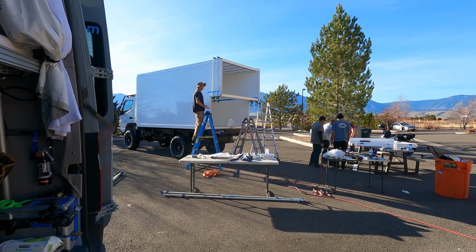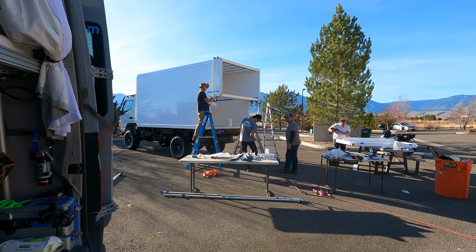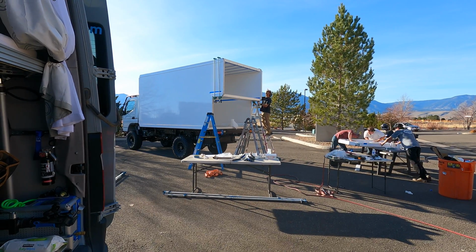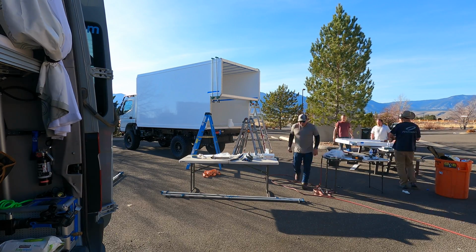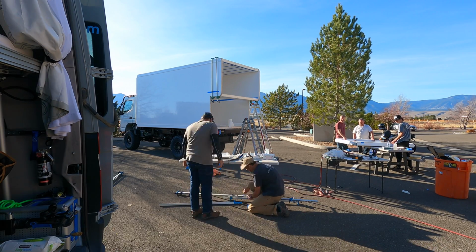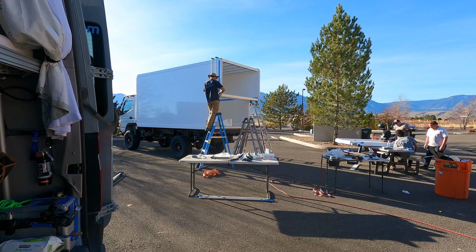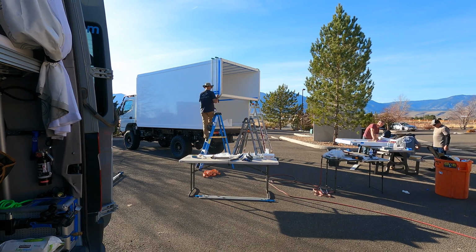And so now that these clamps are on, we make sure they're tight and clamped up well, and that the adhesive sealant is gluing and holding that upper rear floor that's clamped on there, and that we're not causing any scratching on the camper body and are also not in the way. Then we got other clamps ready and prepared that we're going to use a little bit later. This really helped us make sure that everything was lined up, queued up, and ready for what was going to be a very tough lift and installation of this upper rear wall.